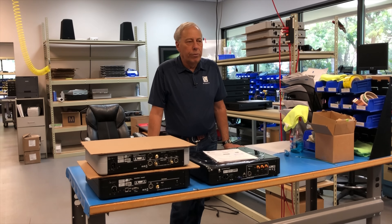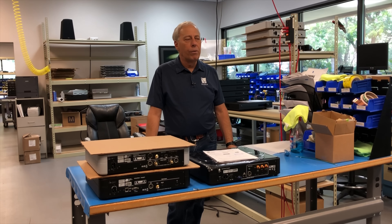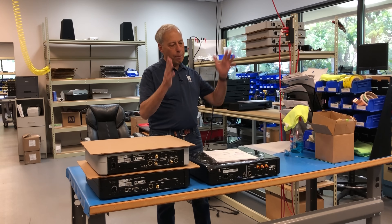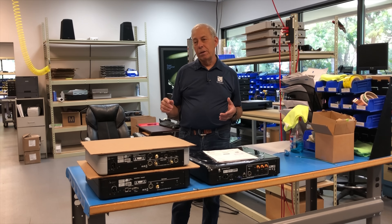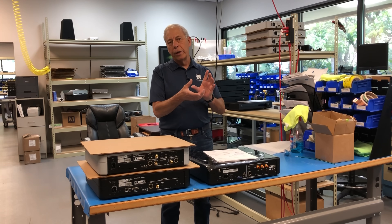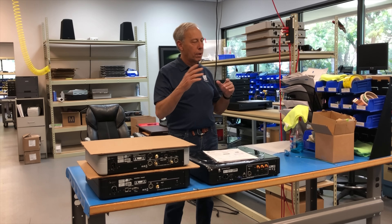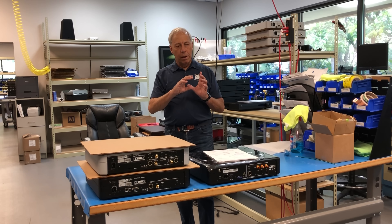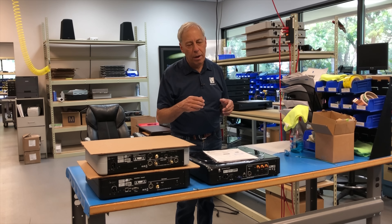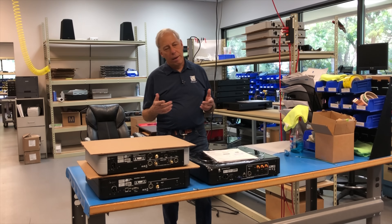And then there are dipoles, like we like, and there are open baffle speakers — there's all kinds of speakers. If we look at a ported speaker, we've got a box with a hole in it essentially. Some of the holes are fancier than others, but most of them are just simple holes with a little venturi, a shaped area, and usually a tuning pipe — just a bit of pipe that, along with the flange, helps reduce the chuffing sound, or farting, whatever you want to call it, that comes out. That's what a port does.